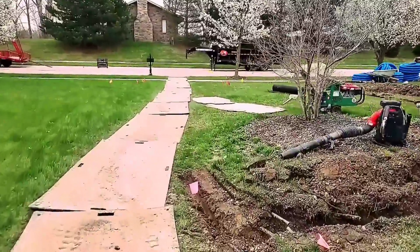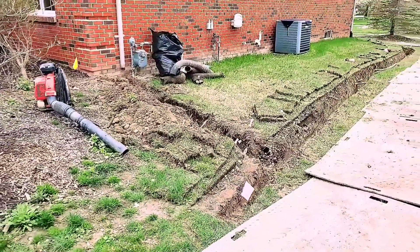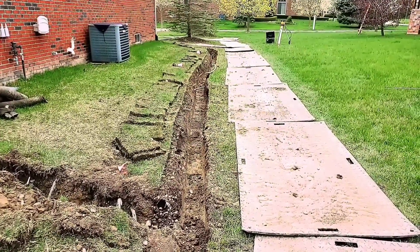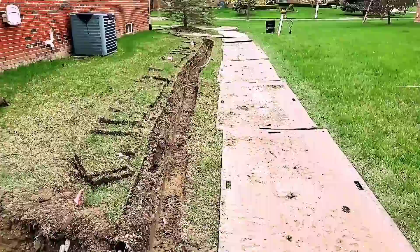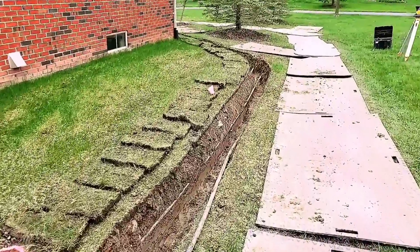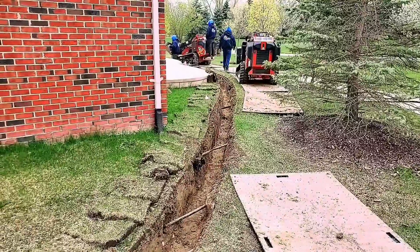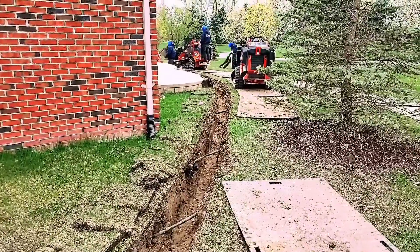It's no big deal. I tell people when they buy new homes and discover they need to put in a drain — don't worry about it, there's a solution. We tighten up this yard. Water always finds the lowest point, so that's where you want to put your French drain — right in that low swale where the water always ends up. It's pretty easy: just run that pipe through all your low areas on one percent slope. Get it to a ditch or a storm drain. If you get so deep you can't drain to the ditch or storm drain, put a pump system in — the pump will lift the water up out of the trench and inject it into the storm drain. That happens a lot. We've got a playlist of outdoor sump pump jobs on our channel.